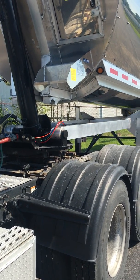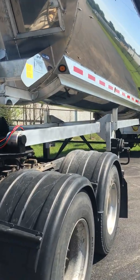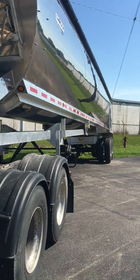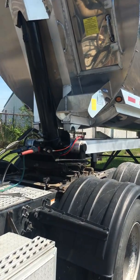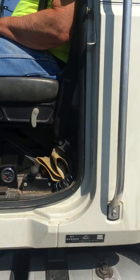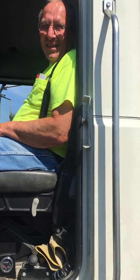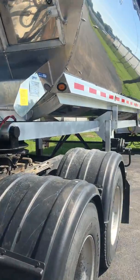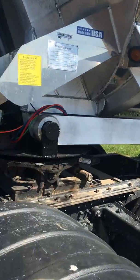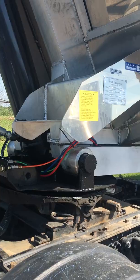So if you were dumping and it became unlevel — back up — the light comes on. You can see the light is on, and the bed is coming down automatically. The driver is not controlling the up or down at all. This is how the system works: if the light is on and you have a full system, the relief valve is open and the bed comes down, or it won't go up.